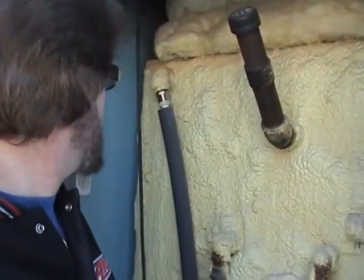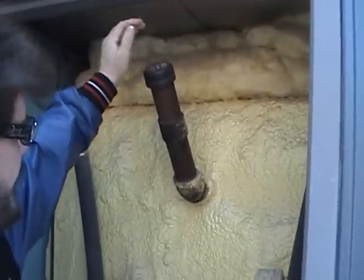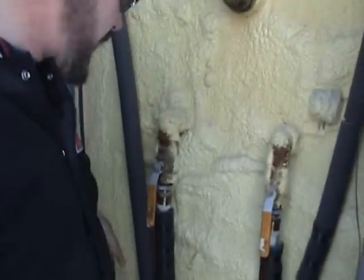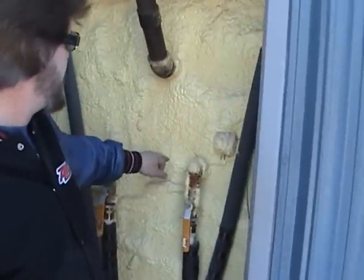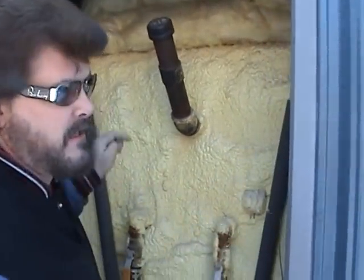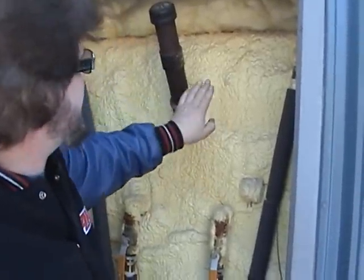The firebox is 375 thousandths thick, it's round, and there's not much weld cracks on it for anything to happen. This is our fill pipe — this is where we put the water in when we first set it up; we haven't used it since. The exhaust comes up through that tube and I made a heat exchanger box that was 4 inches high, 36 inches wide, and 48 inches long, and the smoke travels horizontal and then goes up the stack. So I'm stealing as much heat out of the exhaust as possible.